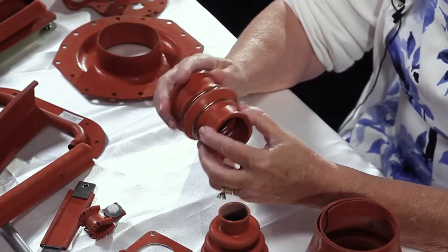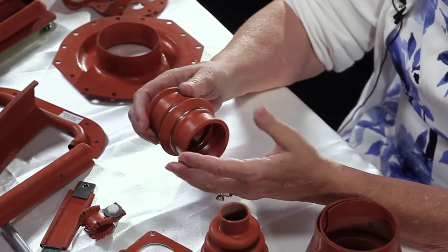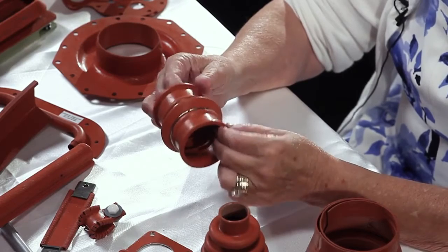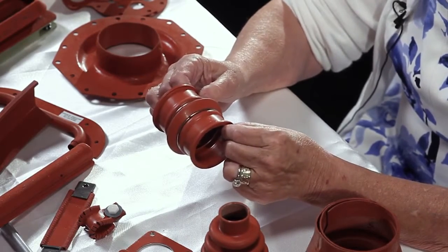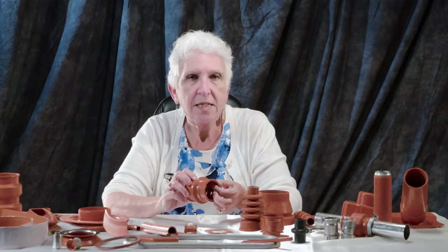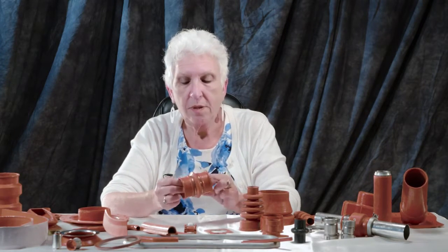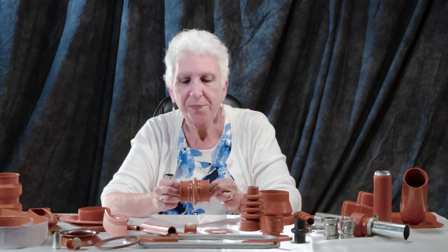Because we don't tape wrap, we compression mold. The burn through and the leakage through the body are non-existent issues because any air that was entrapped would lead to huge bubbles in the process of forming it. And the density is so much greater that you cannot get leakage through the body. In fact, the density for our material at 50 thousandths thick is half that of aluminum. We use 50 thousandths as our baseline for all testing, just as a point of information.